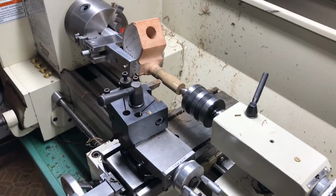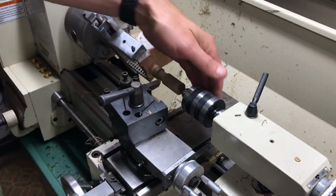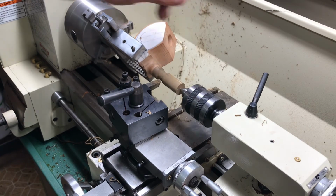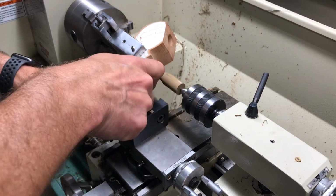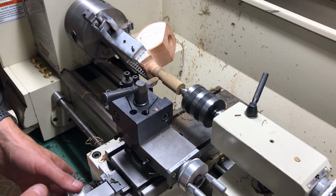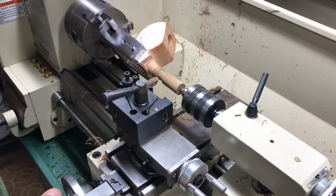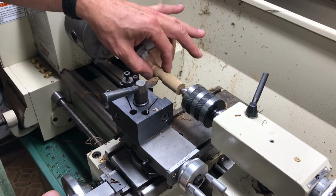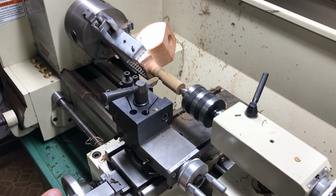Okay, I have the stem on the pipe and everything chucked up. I have the live center here in the air hole. So now I'm just profiling the stem a little bit, and then I'll take some sandpaper to it in a minute here. Just start cleaning it up so it's pretty much close to sanded and finished up at the top portion here.